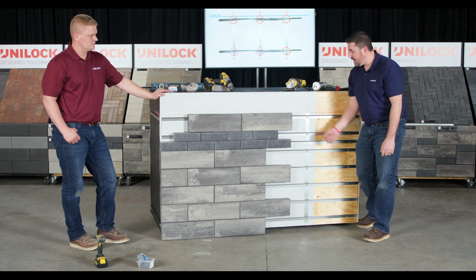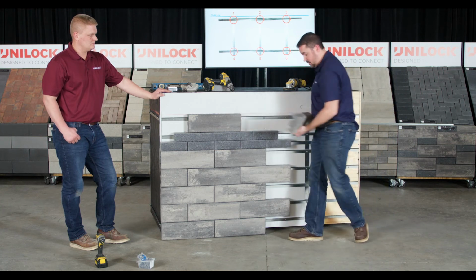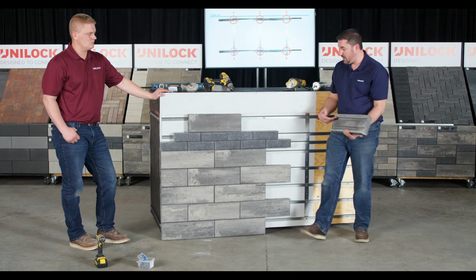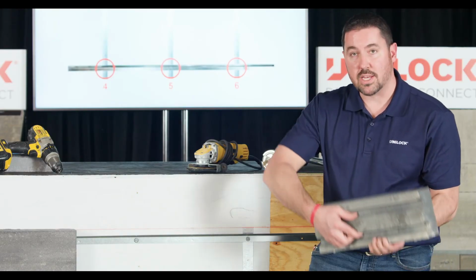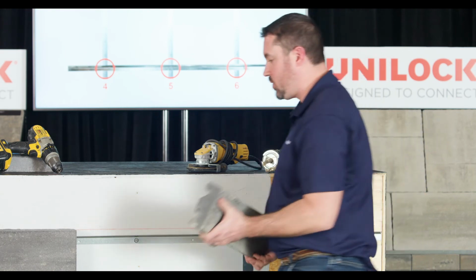One rail is sufficient, and ideally that rail would attach to the top groove in the back of that panel. It will work on the bottom groove, but ideally you're putting it on the top groove, so you've got more weight pulling down against your substrate as opposed to the weight kind of wanting to pull away from the substrate.